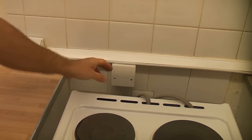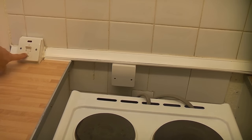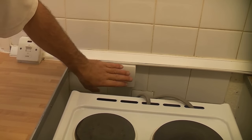I'm now going to wire this electric cooker into this cooker connection unit. You can see that the isolator is there — we're just going to check that it doesn't illuminate once we switch it on. We're just going to go and lock off the MCB at the consumer unit for that circuit just to be safe, so it actually connects to that.